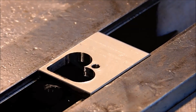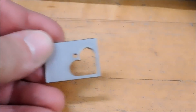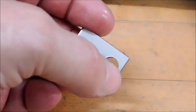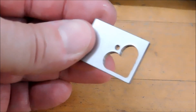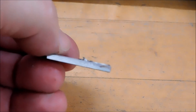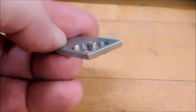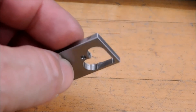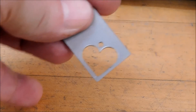Let's throw it on the bench and take a look. For those of you who have asked how to make a heart — that's how you do it. A pair of overlapping holes set at a 45-degree angle to each other. Make sure they overlap and break out. You can adjust whatever you need to adjust. I'm going to put this across the belt sander, round some of these corners off, and probably get a die grinder to do the top work. And always in stainless, you can expect the back to blow out like this if you don't have a backing plate. That's completely normal. I was pecking at it real slow hoping for decent surface finishes on the inside, and I think I've achieved that. Let me swap the blade on the bandsaw, do some close-up work, and we'll clean this up.